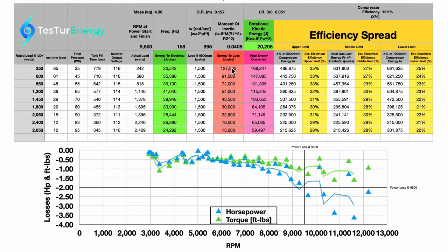Something you'll notice is that the amount of energy that went to loss is a lot higher for the low load run, because it ran for a lot longer and had to push through the loss for longer. So from calculating the loss and how long that loss was pushed through, we get the energy to loss. Adding these together we get the total energy converted. This energy to loss — going through gears, bearings, and direct shaft to generator — should be mostly recoverable. The kinetic energy of the disc at that RPM is 20,000 joules. This is the least efficient use of air — when the turbine was spinning up.